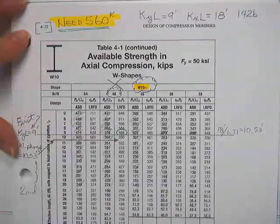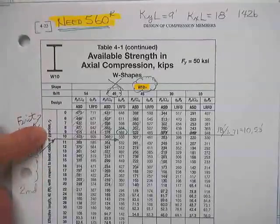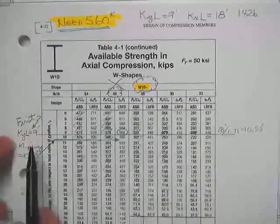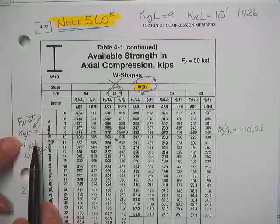We have found that these tables are only good with respect to the weak axis of gyration. But that's not true if you're willing to get a phony K — in effect, take that r sub y out and put r sub x in. You can still use these tables, but you've got to start with the weak axis and check the other one no matter what.